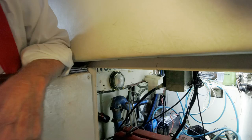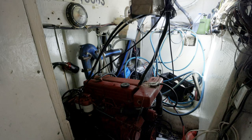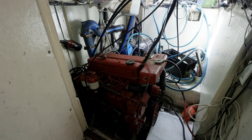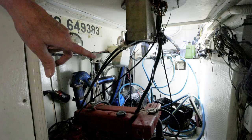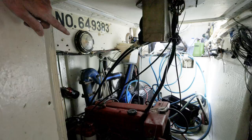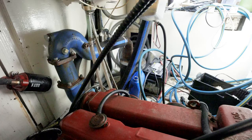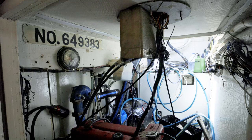Oh wow — look at that! Have you ever seen such accessibility? Only on a few boats. That's a fuel tank on the other side, and there's a fuel tank under here right behind us — those are the two wing tanks for the fuel. This is a Ford Lehman with a hundred hours on it since total rebuild. The original one was 62 horse; they went up to a larger size, an 82 horse. This is actually an engine room — not just an engine space. You could probably fit a generator on that other plateau on the other side. The giant blue pipe is the exhaust from the engine — it goes over to the water muffler on the other side, which exhaust the engine and combines it with water used as coolant coming out of the ocean.